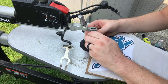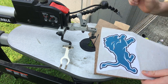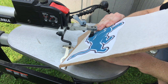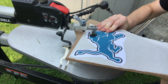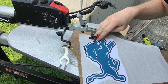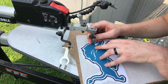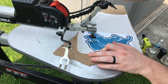First things first, I've got to undo the clamp — undo the thumb screw — just loosen this up a little bit, undo the clamp so it exposes the blade right here. Then you just find out where it is on the back and feed it through, kind of like that. I probably could use a slightly bigger drill bit to make it easier, but the cutouts are so small I don't want to use too big of a bit. So I clamp it down, make sure everything is tight, and then I'm going to start slow.